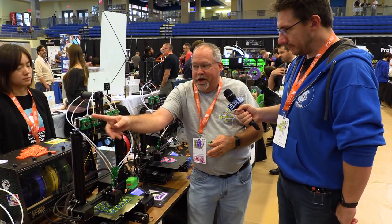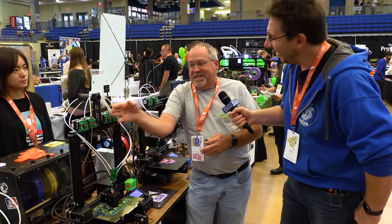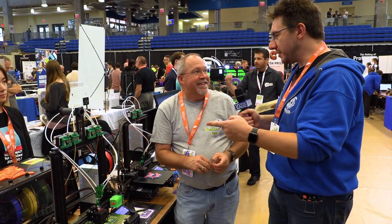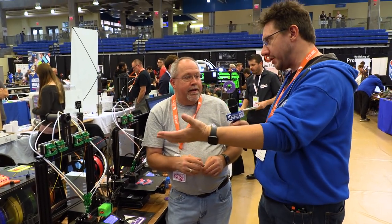The G-code tool change just selects which sequence of buttons to press. If I'm switching from one to the other on this side, it's a left button. If I'm switching from this side to this side, it's a right button. And if I'm doing both, it's a left button and a right button — it just taps one, goes over and taps the other, and then loads the filament. It's a mechanical switch for the power for the steppers. So as far as the printer's concerned, it's just talking to one motor.